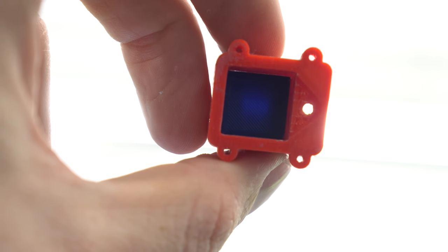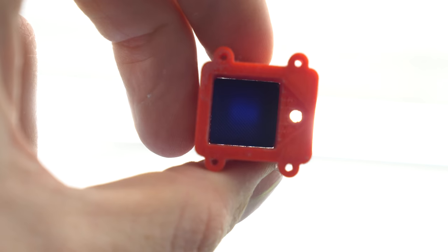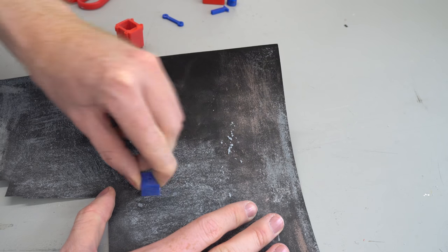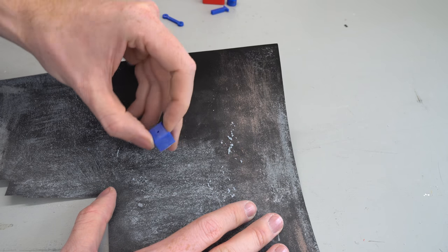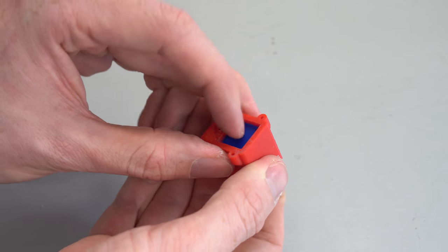During the sanding process, make sure to occasionally insert the piston into the cylinder in the correct orientation, and hold it up to a light to check for gaps. It's important to make a note not to sand these areas where the light leaks through, as this can cause air to leak through and reduce the efficiency of the engine. Once the piston fits into the cylinder, it's time to move on.